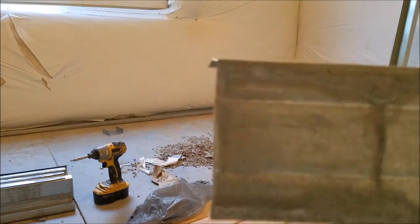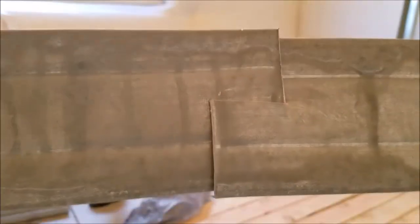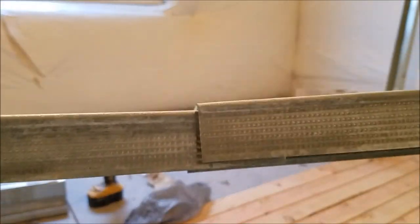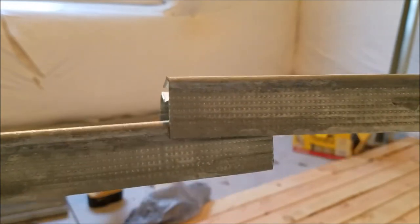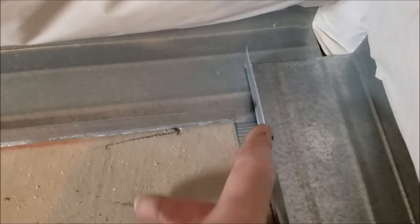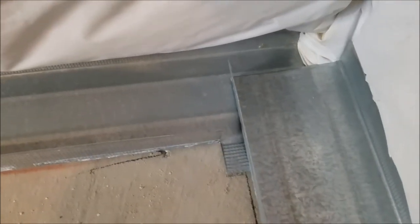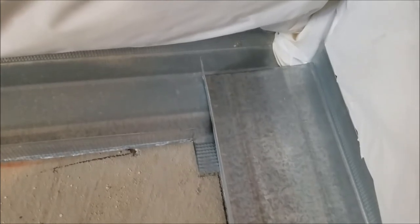I like to shoot them down about every sixteen inches, on sixteen-inch center stud. Now when you come together with two pieces of track like this, you want to cut it in one of them — this doesn't have to be perfectly centered or anything — so you can slip the other one in like that. The reason is when you put a stud there, you don't have a stud at a joint; you have it on a full piece of track. See that notch I cut right here in the track? I'm going to put this in there, and then the sheetrock will slip back in there — I'll put what we call a slammer stud, and it makes a better corner than a normal corner.